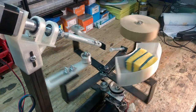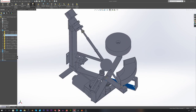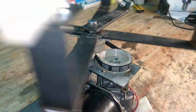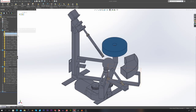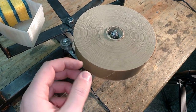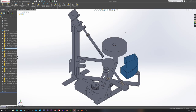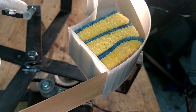This machine can be broken down into three parts: the chassis, the pasting assembly, and the shell spinner. The pasting assembly rotates around this pivot and is powered by this 12 volt wiper motor. The assembly itself can be broken down into four different components. This is the tape spool, mounted on a pivot to allow it to unwind without any friction. This is the tape dampener — it's simply a box filled with wet sponge to activate the adhesive on the tape.